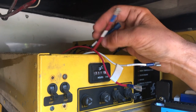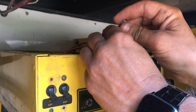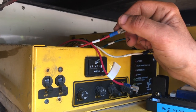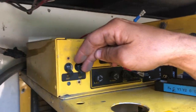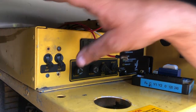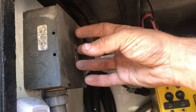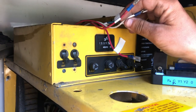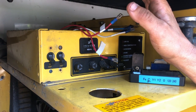After that I took a 12-volt DC battery — a regular 12-volt battery — and connected that to these two wires while the generator's running. What that does is it excites the commutator which puts out your voltage. Because it's not regulated you get just whatever voltage it puts out with 12 volts input. I have a control here and these are my wires coming out of my generator — my power wires. I wanted to check it on the other side of my fuses to make sure I did not have an internal fault inside my cabinet or inside here. They tell you to do it before the fuses. I took this and opened it, disconnected the wires — I basically isolated all the wires and didn't allow them into my RV. When I did that, I put 12 volts to the two brushes and I got 32 volts on both legs, which means it's working perfectly — I had no shorts, nothing happened. It ran perfect at 32 volts.